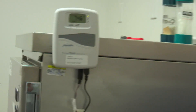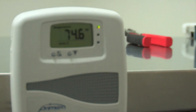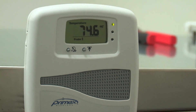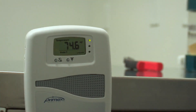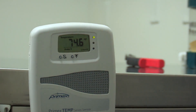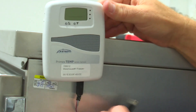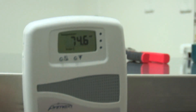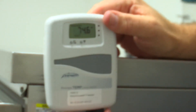Once plugged in, you'll see it zero out and then display a temperature. At the bottom, it will display 'signal OK' or 'no signal' depending on whether it receives a valid signal from the wireless access point. This may take a couple minutes. Now that the display shows 'OK signal,' the first test is to make sure the battery backup works. We're going to pull the AC power plug — it's going to zero itself out, then reset and display again — showing that it's gone from AC power to battery backup. We'll plug this back in.